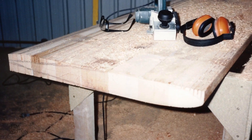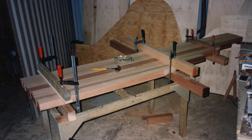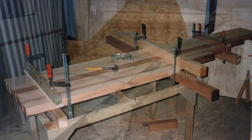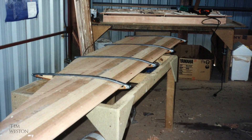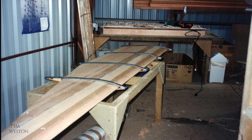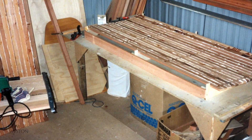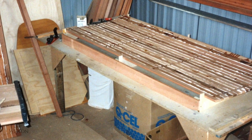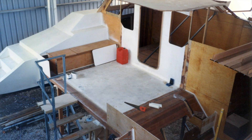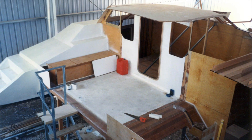I made the two centreboards by basically carving them out of solid cedar — lengths of cedar were laminated together, sawn and planed, then hand carved down to a final shape. I wouldn't do this again; the process was extremely laborious, the final shape was only a rough estimation of the real profile, material costs were high, and it was heavy. In fact, in the first year the boat was in the water I slipped it and replaced both centreboards with one large megaboard — but that's a whole topic on its own I'd like to cover in future videos.